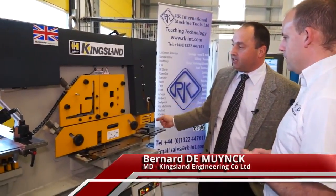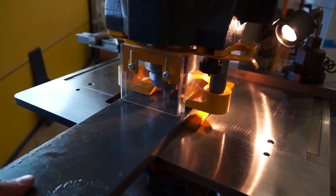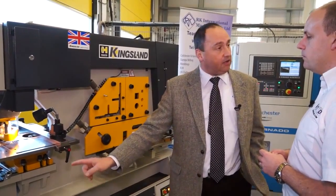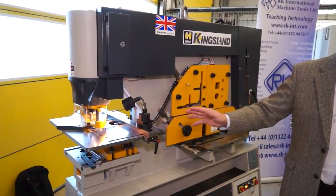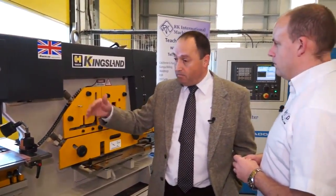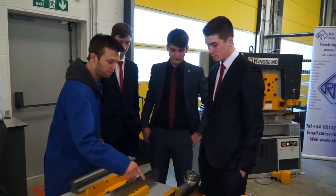Can you tell us what it does? It's a classic Kingsland Steelworker as we make them already for decades, but more up to date of course. It has five working stations. This is the punch end, which is separately commandable, so you can work with two persons on this machine. This end is operated from this side with one separate foot pedal. You can adjust it for all kinds of special tooling, bending tooling, forming tooling — it's a whole library, even special tooling specially adapted for the people. You can adapt it also with a feeder, CNC feeders. You can have a CNC table or even a clamp master table. There's a whole range of possibilities starting from this base machine.